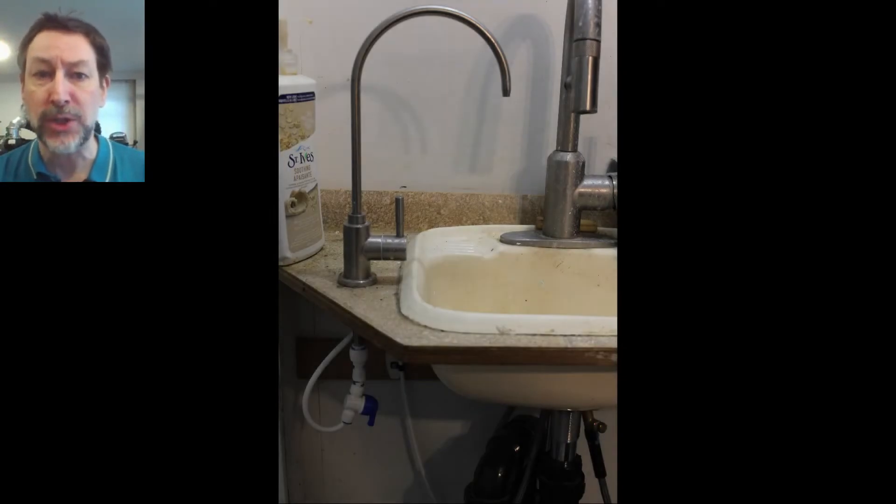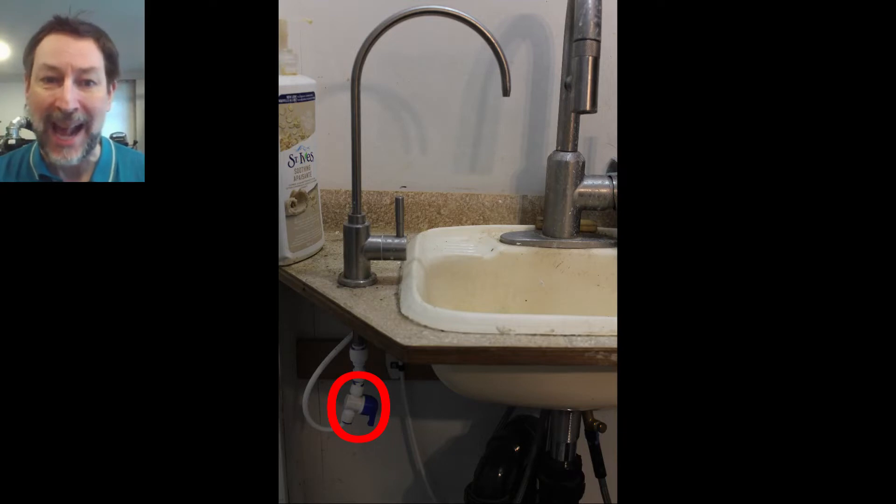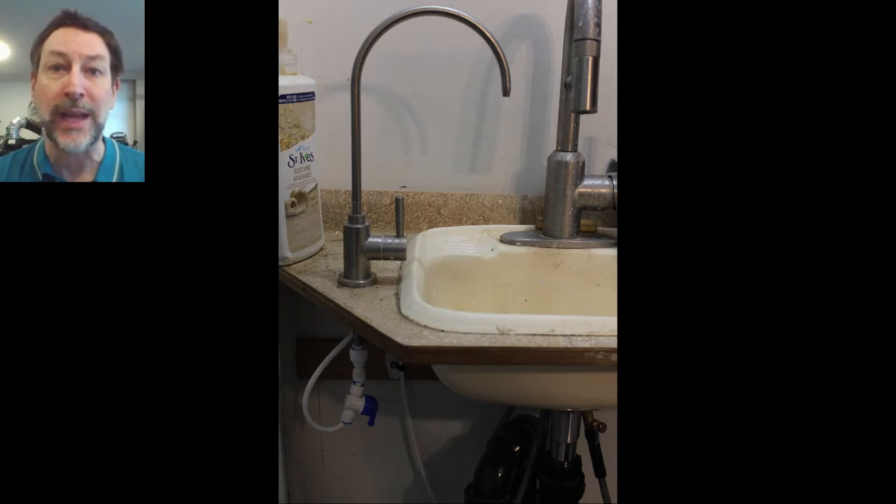When I got this water system a few years ago I put a tap in the two bathrooms and at the kitchen sink. I'm just going to be branching off of it. If you look under the tap there's a little shutoff valve — meaning if the tap needs to be changed, the whole host water doesn't need to be shut off, just that specific tap. I wanted to maintain that continuity with the refrigerator as well, so when it needs servicing the water can just be disconnected without the house being without water — you don't want to be unable to flush your toilet while the fridge is out of commission.